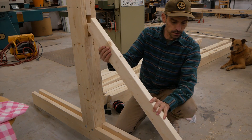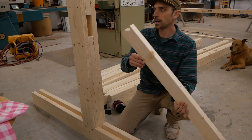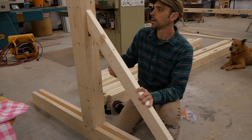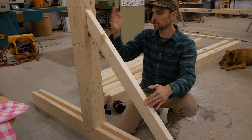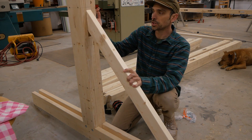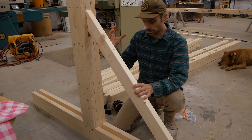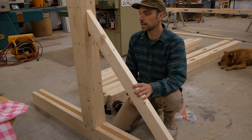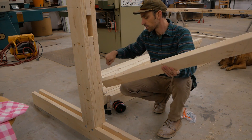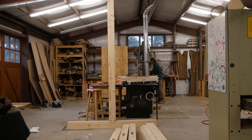I've basically just test-cut this — it's about a 40-degree angle on the bottom, and then I started with a 90-degree notch. This isn't a perfect right-angle triangle, so we don't have 45s and 45s, but it still works fine. It slides right into that notch, which gives it a little more strength. I'll put a bolt here and two bolts here, and that should add some rigidity to it front to back. I'll use this piece to set on all my other pieces, scribe it off this one, and cut them all out.